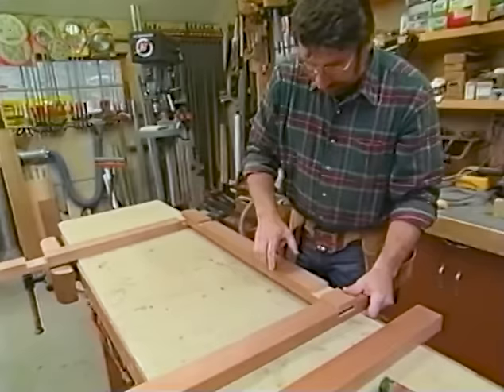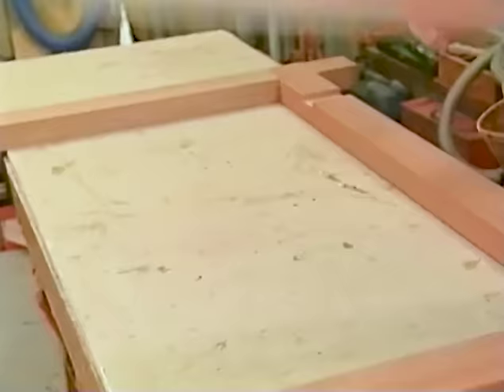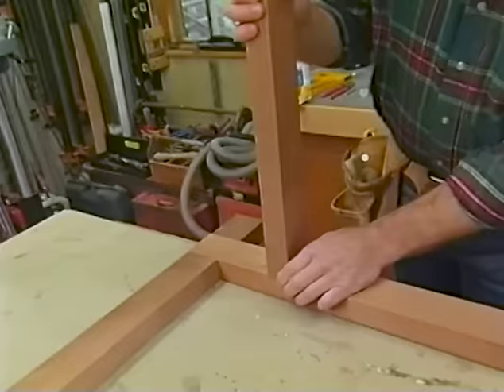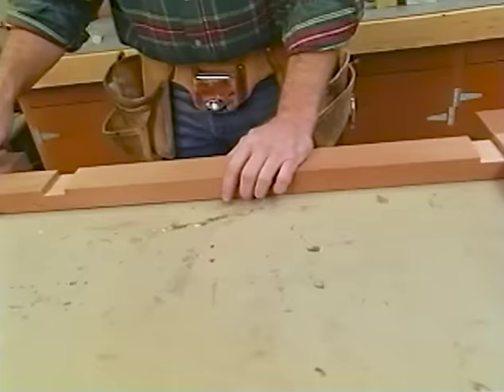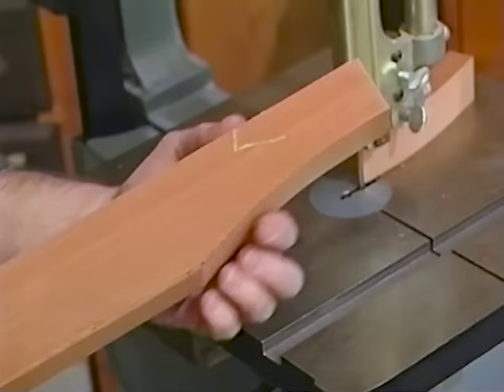This is a good point to do a dry fit to make sure all the joints fit properly. This is the lower cross piece, which holds the lower storage area; these are the uprights; and there's a top piece that goes across fitting into the lap joints — this end will be our handle. The dado I made is for a cross piece to tie the two side assemblies together. There are several more steps: forming the handle so it's comfortable to hold, putting a dado between cuts to receive the bottom shelf slats, and drilling a hole for the axle.